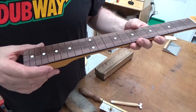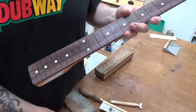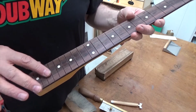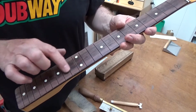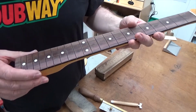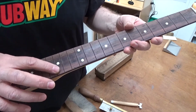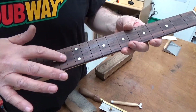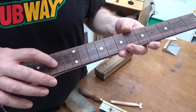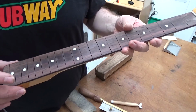Just quickly before we move on to preparing those frets, when I was doing that levelling with the levelling beam, you will have noticed that there were some areas where it didn't cut down and didn't take off much. This is where the guitar's been played quite a lot and it's just worn a bit. But you'll notice, I don't know if this is coming out on the camera, but where the groove of the slot is to either side of that, that has been taken down a bit. So I'm not worried that because the beam didn't take out these bits between the slots that it isn't level for installing the frets, because the actual area just to either side of the slot has seen a little bit taken off, so it's all level.